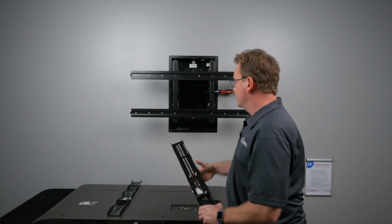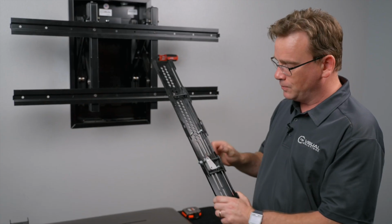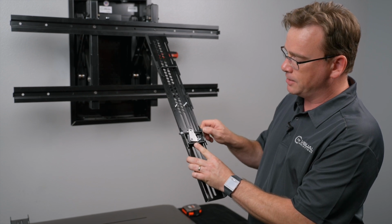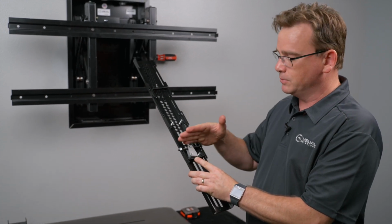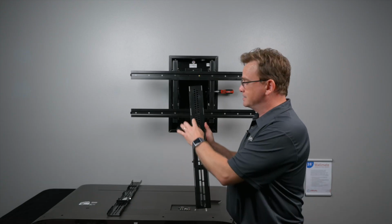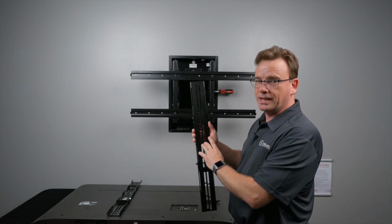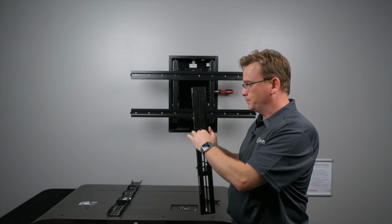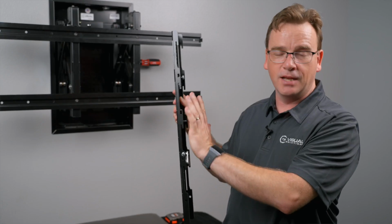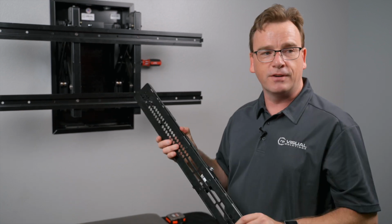Once we have it up, if the box or the universal kit is not perfectly level, before we mount this on, because you won't be able to see it, we can actually use the cam, which actually allows you to get a fine amount of adjust, and actually moves this piece up and down, giving you an infinite amount of adjustment. It actually moves about 7 millimeters up from one point down, and then the spacing on the holes is 6.25 millimeters, meaning that you can actually go between all holes all the way down and have the display end up anywhere in between. If you only move one arm up and down, that basically gives you rotation. If you move both arms, that gives you finite height adjustment. So you can actually get all of your fine adjust from your universal mount.